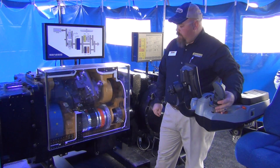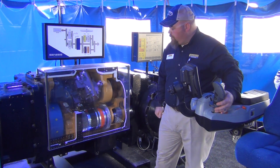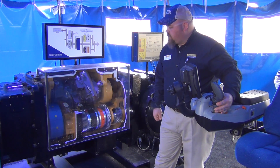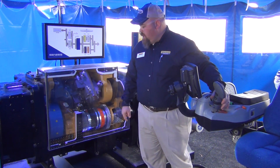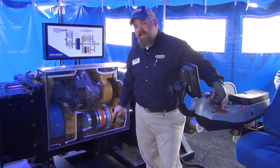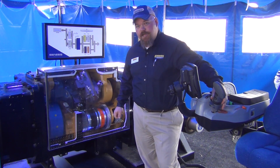As I start to move in a forward speed, you'll see clutch number one starting to turn. You'll also see the ring gear — the blue gear — starting to slow down. The first time the ring gear fully stops is when I'm using 100% mechanical efficiency in clutch number one. The power running through the transmission is coming directly from the engine; I'm not using anything from the hydrostat unit.